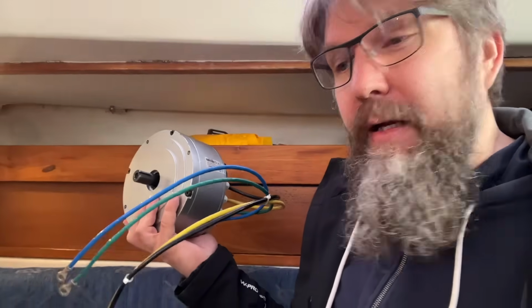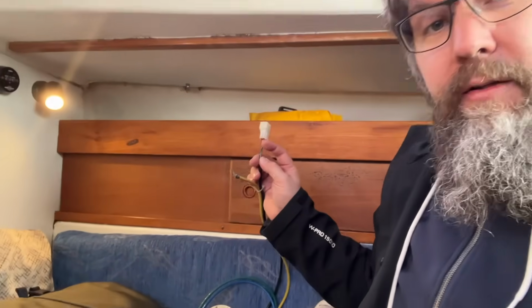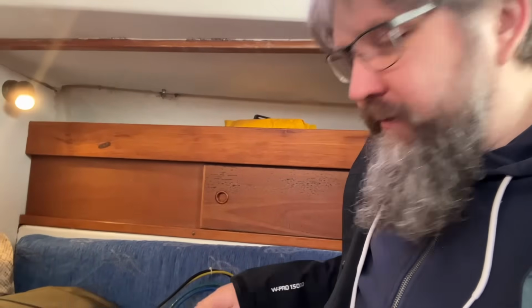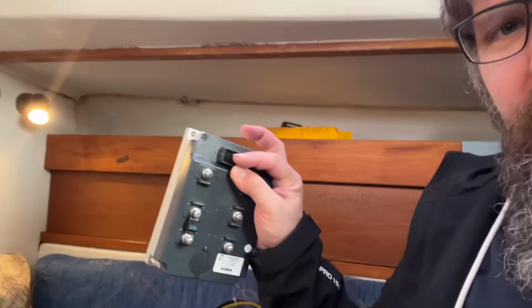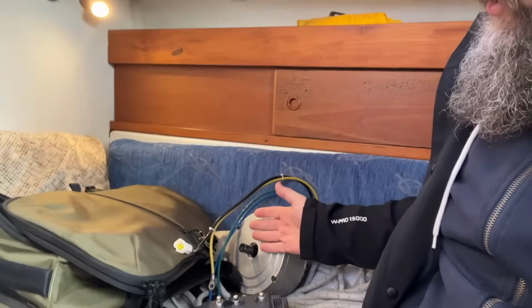However, now when we come to the weak link, it lies behind this 4th cable that has many thin wires. These wires include a temperature sensor, but they also include Hall sensors, which are magnetic sensors. And that comes from the fact that this kind of motor always needs a controller to rotate it. So here you can see there are these 3 poles and power in with those additional ones. And this connector here includes all the controlling things. So in order for this to work, the motor needs to have sensors to tell this controller where that magnetic field, those permanent magnets, actually are. And those sensors inside the motor, they are the weak link.